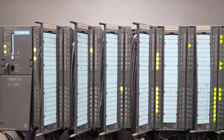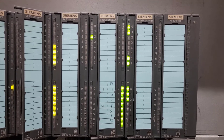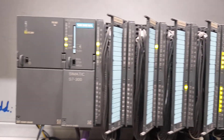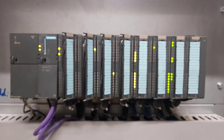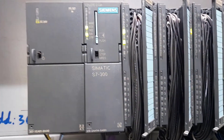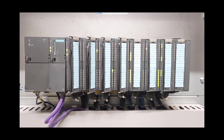This is the rack of the Siemens S7-300 PLC and all the modules are plugged into this rack — the digital input, digital output, and analog input modules. The power supply module is the very first one, followed by the CPU S7-300 module. A Profibus cable for Profibus communication is mounted onto the CPU Profibus port. This rack of the S7-300 PLC has a total of 10 modules including the power supply.